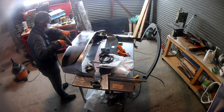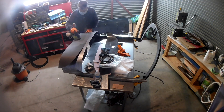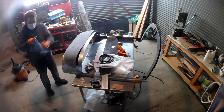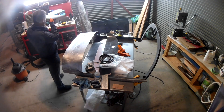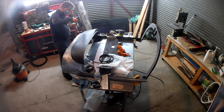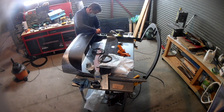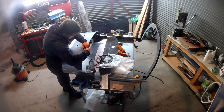I don't want to go any finer than 400 grit because I don't want to start creating any shine. I want this to be matte — it's a glare shield, not a glare amplifier. Once it's done I'm going to spray it with a couple coats of clear matte enamel. It still maintains that beautiful carbon fiber finish underneath but it's matte, not that prototypical shiny gloss stuff, which would be pointless — if you turned towards the sun you'd be blinded.